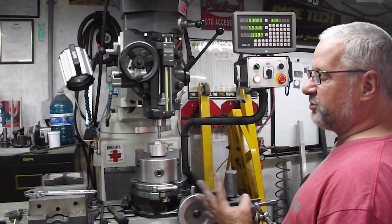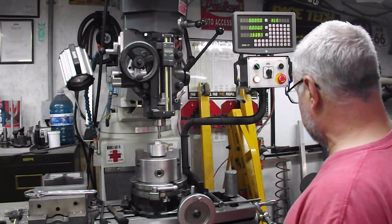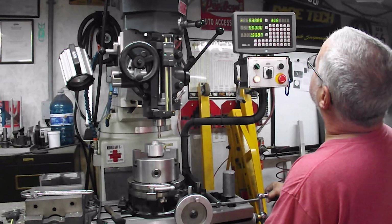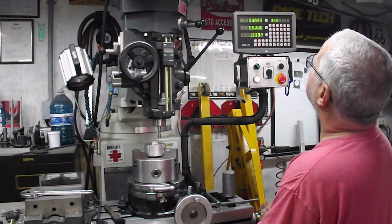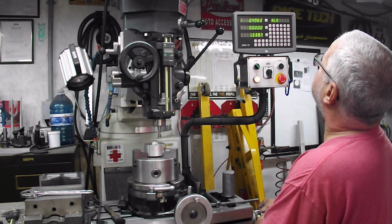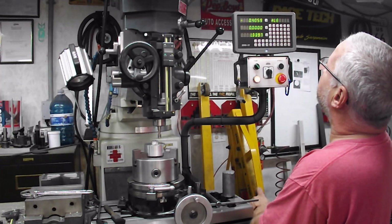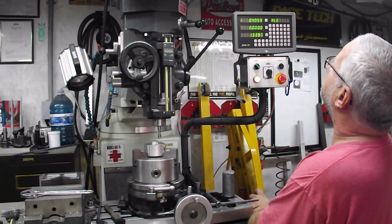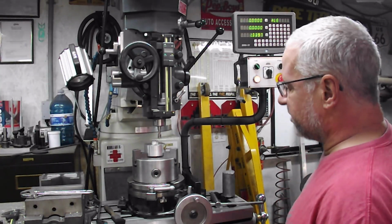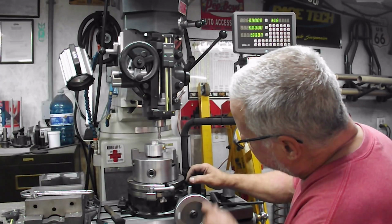Now I've got .8125, so that divided by 2 is going to be .406. So what am I going to do? Looking for .406. Fun to hit that 6 number, that dead on number when you've got tenths on your DRO. Done splitting hairs. We call that zero now. Okay. One more thing I'm going to zero.